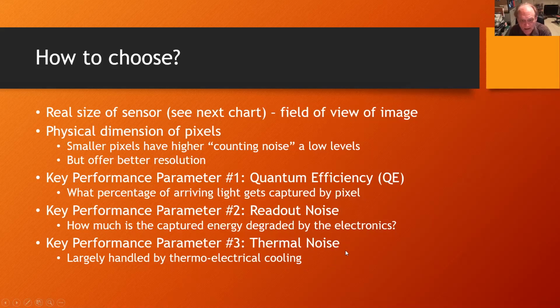That's one of the big delineations between a standard DSLR and a dedicated deep sky camera. Yes, they've improved. The readout noise circuitry is better. They do better noise handling in the astro cameras, but the real big difference is the thermal cooling, which takes some power in the field, by the way, but not a huge amount, a few amperes. Okay, so I think that's the main point.